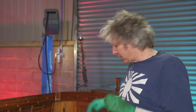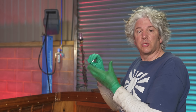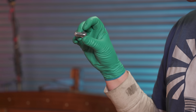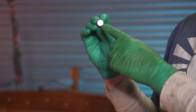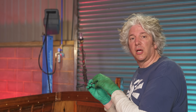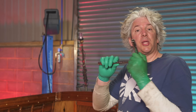When you think about imperial tools, most people think of them as inch sizes or AF. AF stands for width across flats — if you think about a nut or a bolt, AF would be the width across the head. So that spanner or socket is actually defined by the size of the head, and it works the same way for metric. But for BSF and also another standard called Whitworth, it's all about the size of the thread itself. So BSF and Whitworth are defined by the thread, not the head. Just to confuse things a little bit more, Whitworth is a slightly coarser thread than BSF. Also, Whitworth bolts generally have a one-size bigger head than the equivalent BSF, but the same spanner or socket will work. And that is what I'm going to use to undo this.